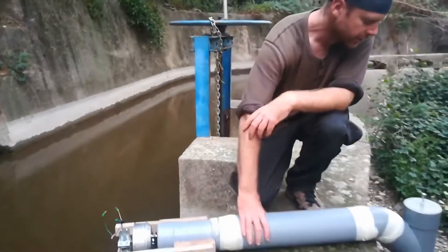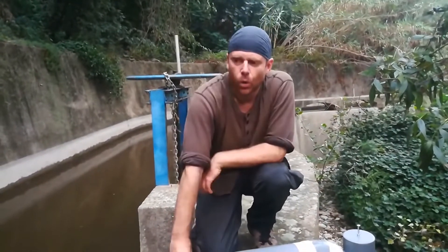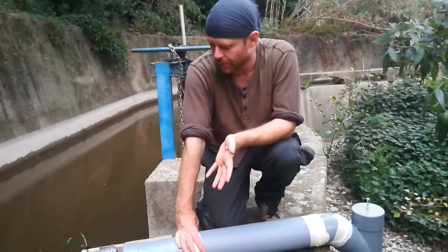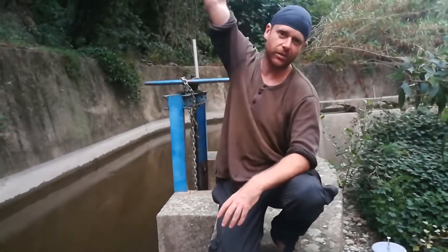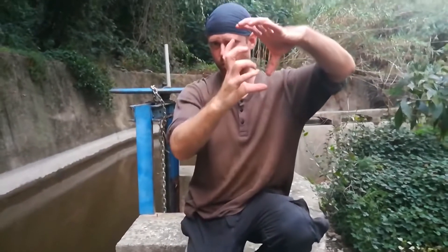With the previous test, the propeller was down the bottom and the water was coming down past it, which is generally how these things are done — feels more intuitively like how a turbine should be. With a Pelton or a Turgo, the more usual setup with 20 to 100 meters of head running a bunch of pipe and having a jet of water onto a spinning turbine wheel, you need to put the turbine at the end because that's where the pressure is, at the bottom.